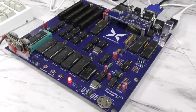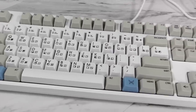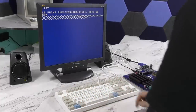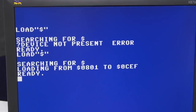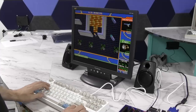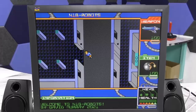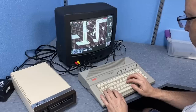The next revision will contain a few minor changes, but nothing that impacts architecture. However, we still have a ways to go before this is actually ready for prime time, as it has a number of software bugs. One problem is with the keyboard routines — for example, it won't even recognize the official keyboard unless you set the jumper to 2MHz mode. This is a timing issue in the kernel that needs to be fixed. Another problem is the SD card: half the time it just doesn't detect the file system, and sometimes it does. This is also a software problem that needs to be fixed. Nevertheless, here it is running at 2MHz mode playing Petski Robots, and the game has been significantly improved since you saw it last on the X16. It made its public debut recently at the DFW Retro Computing Meetup. It's still a work in progress, and I will be doing another episode on Petski Robots very soon explaining some of the development work on the X16 version as well as the Atari version.